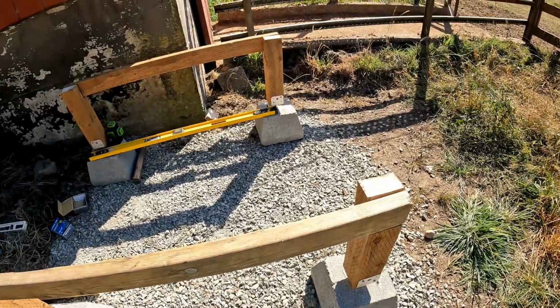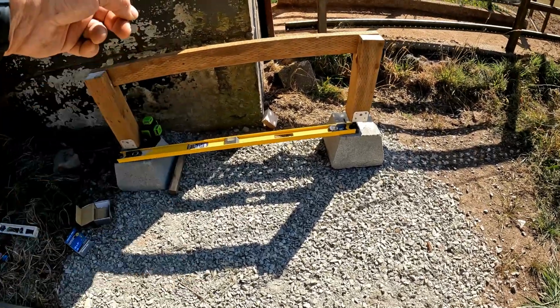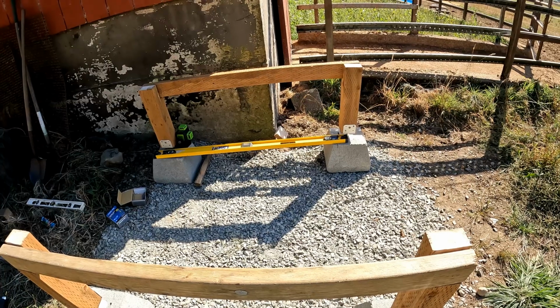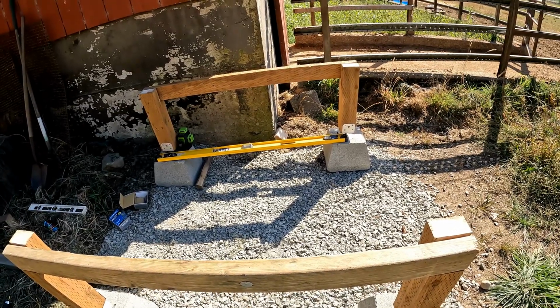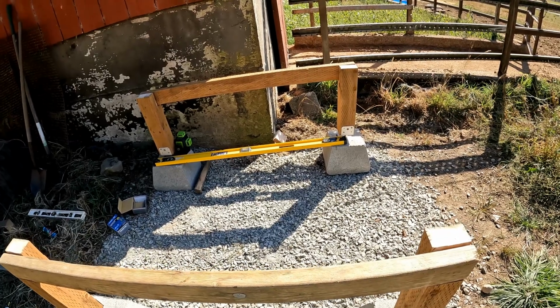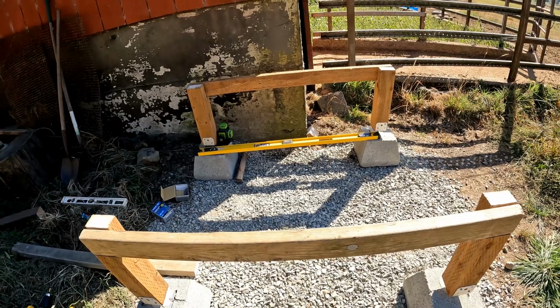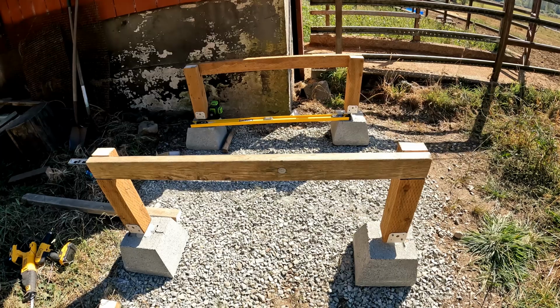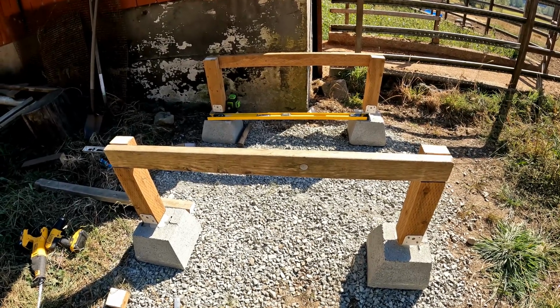And then I'm going to have brackets, 2x4s. I'm going to stick some 2x4s across here, and then put 2 layers of 7/16 plywood. So this should be 4 feet by 4 feet square when it's all done. So anyway, I just want to show where I was at progress-wise, and we'll come back when we get a little bit more going.